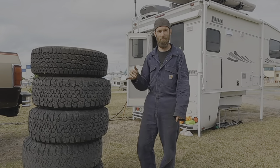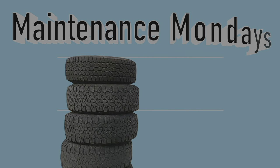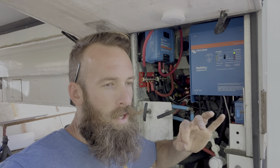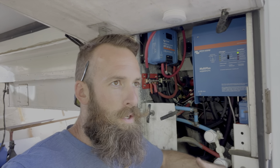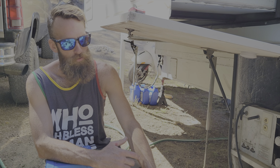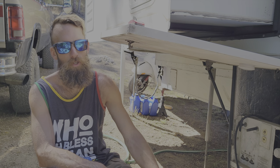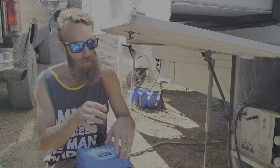There's an amp calculator website where you can calculate what wire size you need for a particular amp draw — there's a link in the description if you'd like to check it out. I plugged in my voltages, amp draw, and wattage, and it told me I needed one-aught cable for 24 volt, but for 12 volt I would need four-aught cable. Four-aught cable is massive, hard to source, and very expensive. When I originally built this electrical system on 12 volts, I didn't know as much as I'm learning now.